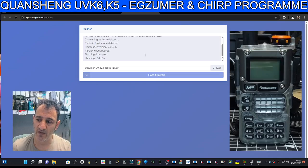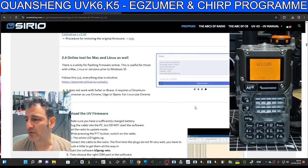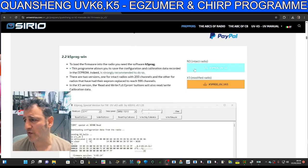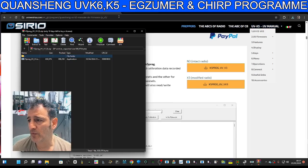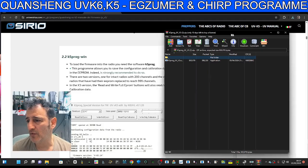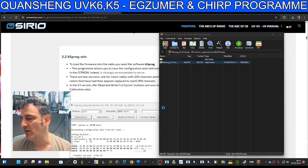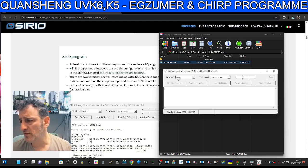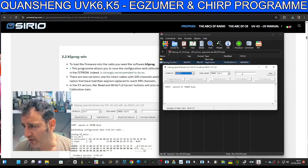There is a recommendation that you make a backup. If you do want to make a backup, you'll need to go to the IJ site - the link is in the description - and download the flashing tool called the K5 Programmer. This is for the unmodified radio - one where a board hasn't been added. The factory parameters set in the radio need to be retained if you want your radio to be 100% fine. Open it up, set your Serial Port to COM 11.